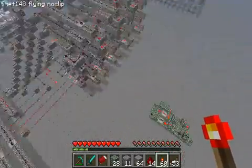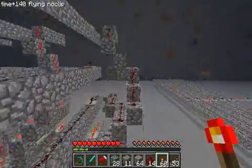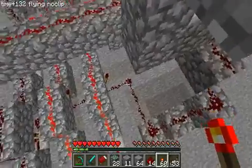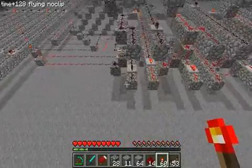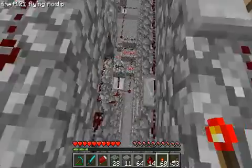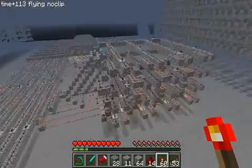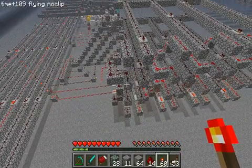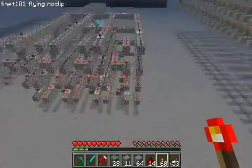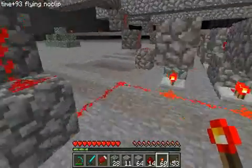I've built the main structure here that's going to mount the flip-flops, which will become the registers. You can see that segment there is one tower and it's all connected to the bit that came out here before. So that means all these bits — that one, that one, that one, and that one — are all connected to that bottom bit down there. That's because we want the entire register to save a value at the same time, so all the flip-flops in a register must have the exact same clock signal. The same goes for each register — those ones are all connected, those ones are all connected, and those ones are all connected, all connected to their respective output from the decoder.